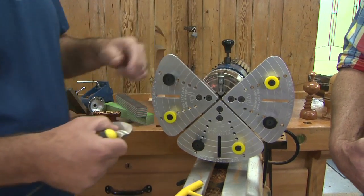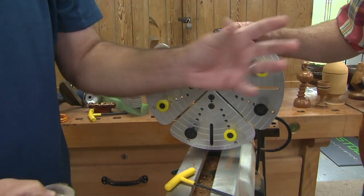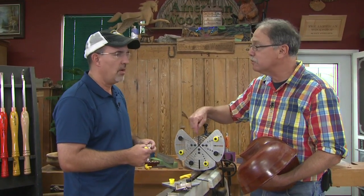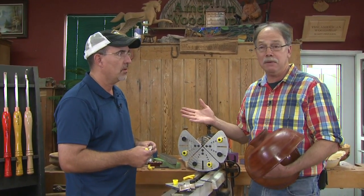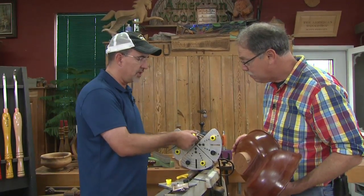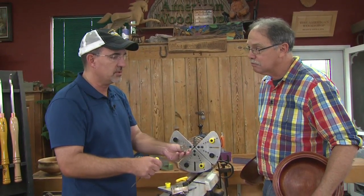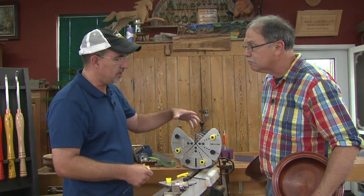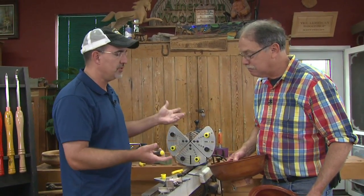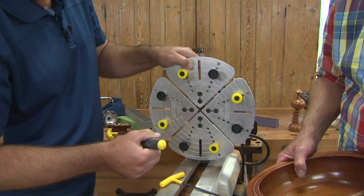One of the main advantages of the Easy Chuck is that in the past you had to bolt and unbolt the jaws, which took about 10 minutes. Going from gripping the foot of something out to the rim was 10 minutes cut to cut, and you had to match the numbers to the specially milled pieces. By the way, all this is made in America and machined to precision. With the Easy Chuck, the jaws change out in about 30 seconds. When we launched the chuck we only had a few jaw sizes, but we're making more and more. Our latest addition — some call them rim jaws or jumbo jaws — we call them the Big Easy Jaws.